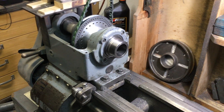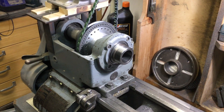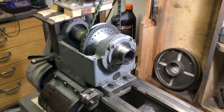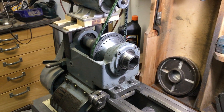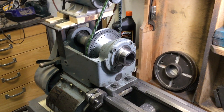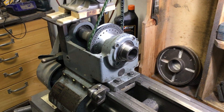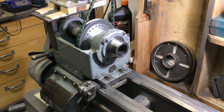So this video is a preamble — I'm going to look at trying to replace that front spindle bearing with a Timken tapered roller bearing. I think I can do it without any destructive changes. We'll have to make some changes obviously, but I'll keep things in such a manner that I can always revert to the original setup if need be. Next I'm going to take off that face plate on the front to expose the bearing.